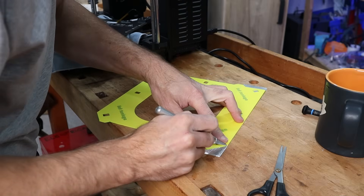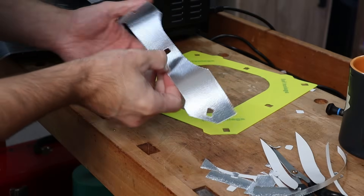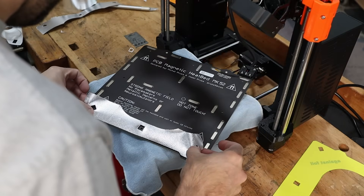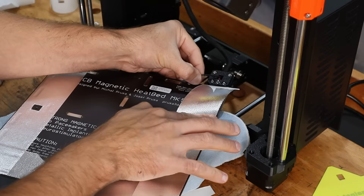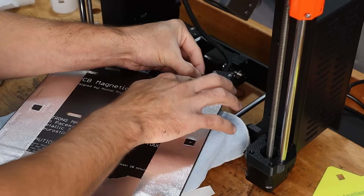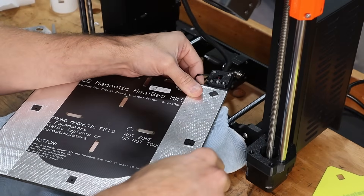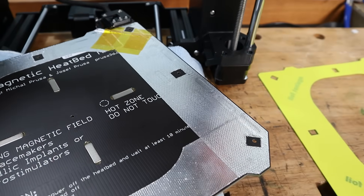I decided to go with something much simpler and cheaper. Using the same template, I cut out four pieces of aluminum tape that overlap each other at the corners — where we were seeing the coldest areas — except where the thermistor is, which should have only one layer. I applied them carefully to avoid the standoff mounting points and positioned the thermistor near the corner just like last time, pulling the wire back already. I applied Kapton tape above the thermistor and then ran the final test.